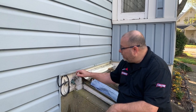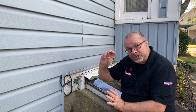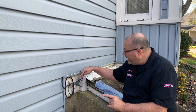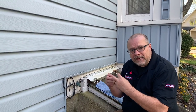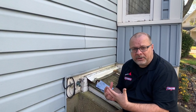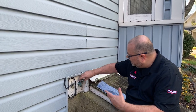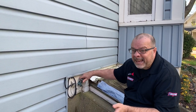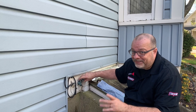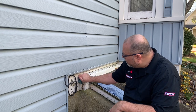So now what we want to do is go back outside to the hose bib and turn it on, because whatever water has been left in that pipe between the shutoff that I turned off and this hose bib, I want that all to come out. I don't want that to stay in there and freeze while the temperatures go down because that'll split the pipe. So we just let it drain. Looks like it's already drained — there's not much in there since I already had it off in the first place. So we know it's dry.